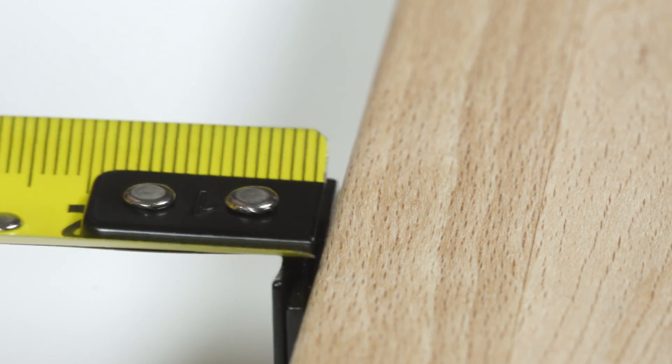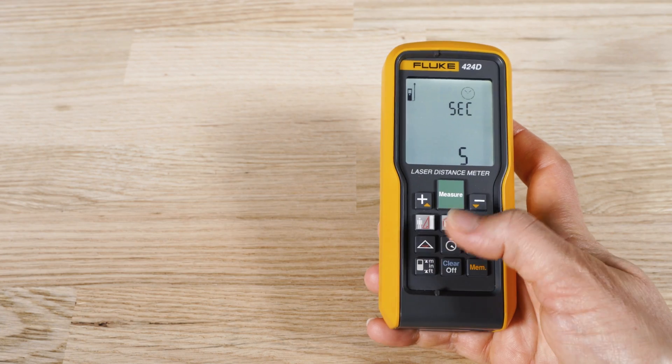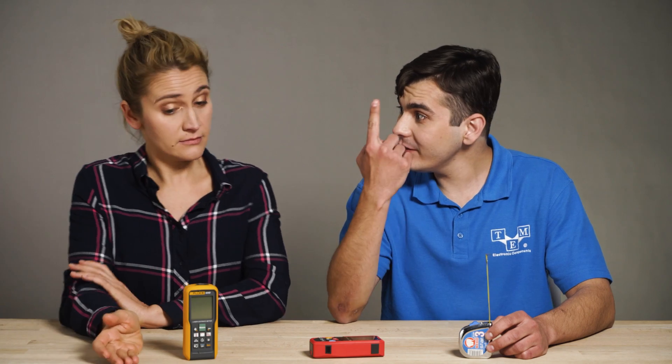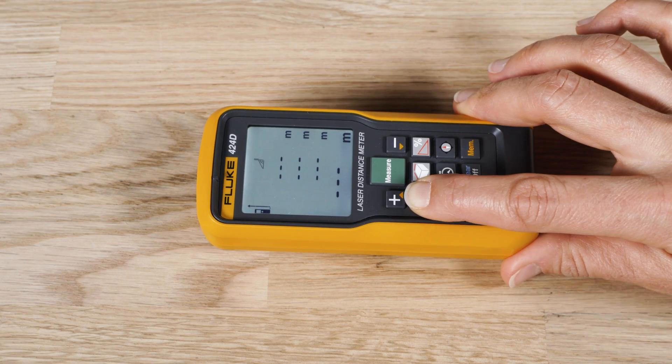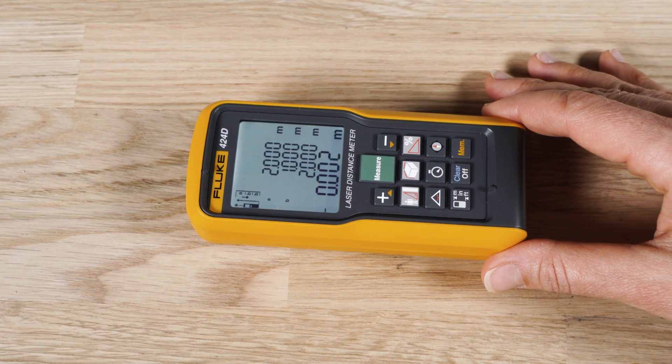Even with advanced technology, the simple and well-thought-out design of the measuring tape has its merits. That loose tip is not a manufacturing flaw — it's a feature. Depending on whether you pull or push the tape, the tip moves forward or backward so your measurement is accurate to the millimeter. If you want to be extremely accurate with the LDM, you can set a timer to prevent shaky hands from affecting the measurement. The measuring tape also has special markings for the most common lengths. But the LDM counters with stakeout measurements, which let you set a specific distance and mark off defined measured lengths — and in some models you can set more than one length, and it will tell you how close or far you are from the target.